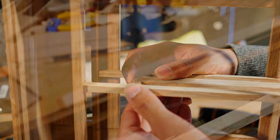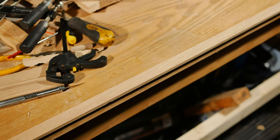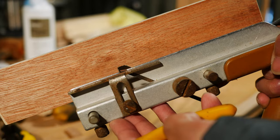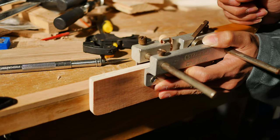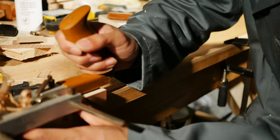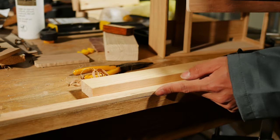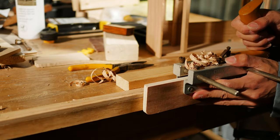We have a long strip of oak, 20 by 7mm, which will become the side panel, covering the box's internals. Let's pick up our plow plane and adjust its depth stop to 1 mm. Make a shallow recess on one side, across this whole strip. Avoiding clamps that are in the way involves planing only a small section at a time, and to reach both ends, a spare piece of wood can be clamped behind us to rest on. It doesn't need to be accurate.